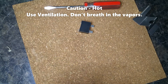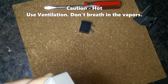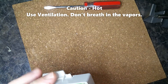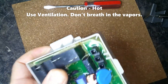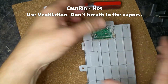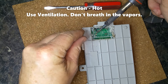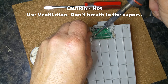Clean the area up a little bit, make sure it's got free passage in there, and the relay just goes right in. Now the relay is seated. You want to make sure all the pins are fully in. From here the hard part's over — now it's just a matter of soldering it. Let the solder flow really well because it's a double-sided board.